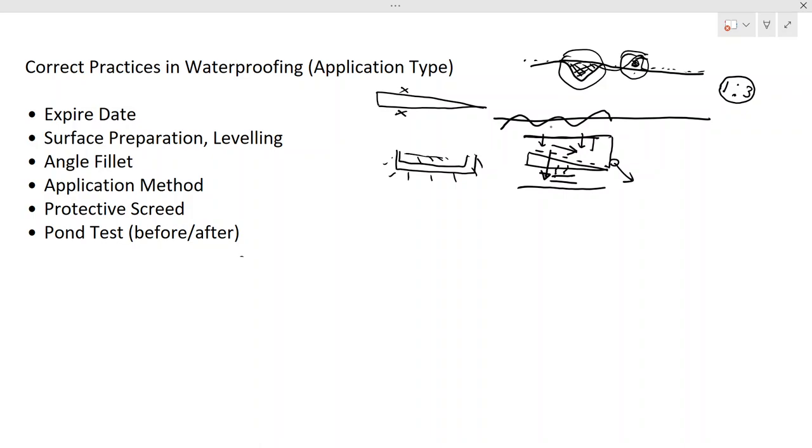The second thing is to avoid dampness. So you know, concrete is a porous material, right? Say this is the concrete, and water has penetrated up to this level. Due to this porosity, water will penetrate into this, and moisture will come into this. So with time, when you have penetrated moisture there, if cracks develop in this surface, again this will be an issue.